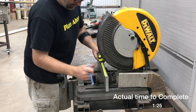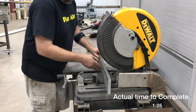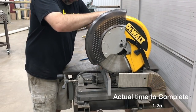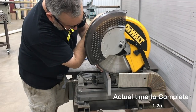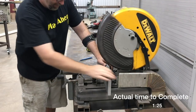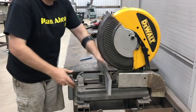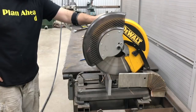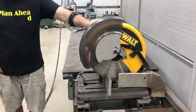This ended up being the fastest method — using the DeWalt metal cutting chop saw. We just draw a line, get it measured up, and line it up just outside the line. The key thing is to make sure the stock is flat on the deck of the base — if you let it tip up a little, you'll end up with a not-square cut. This thing just really powers through the thick metal nicely.